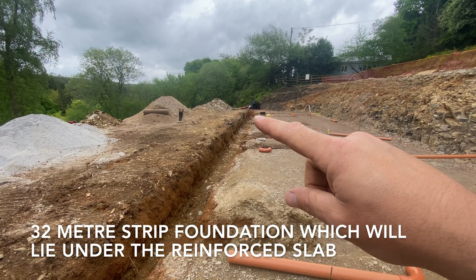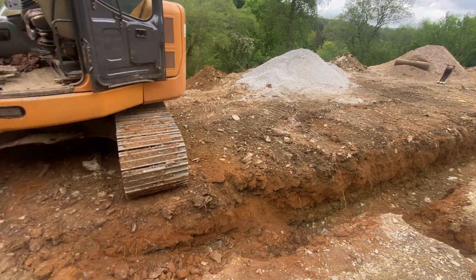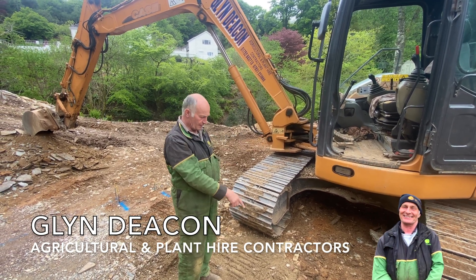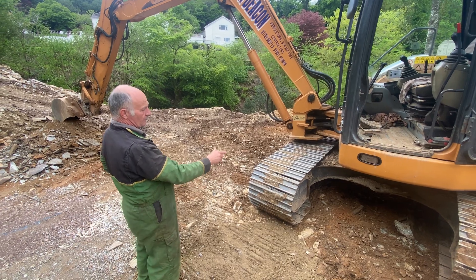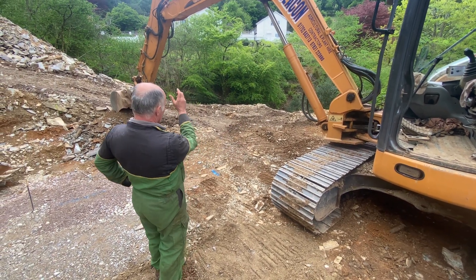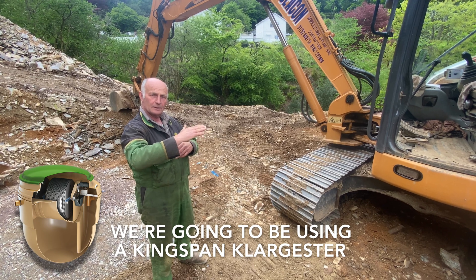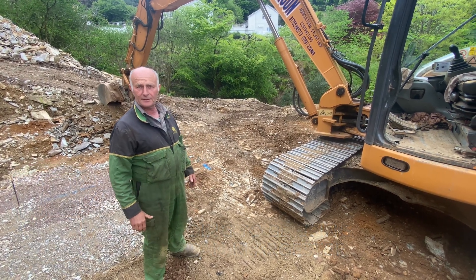Over this 32-metre length where we've got our soil starting here with quite a few lines coming into this soil pipe, what's the depth difference? We must be 150mm lower in the ground, so it'll be about 400mm difference from the start of the run to the end. The reason we want to get down so deep here is that we'll be putting a manhole over there and out there is going to be the septic tank. We don't want the run to dive straight into the tank - we want a nice steady run to the tank, because you can have it too steep and building control don't like it.